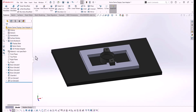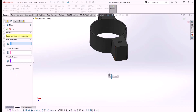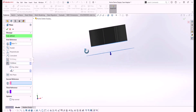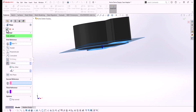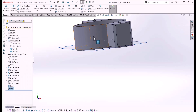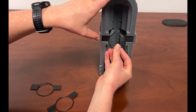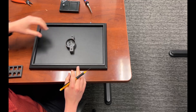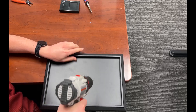As with the vacuum adapters, we set about orienting Notre Dame where we wanted it, reverse engineering and gathering our measurements, and then building out the representation in CAD. Once the CAD model is complete, it's always a good idea to validate your dimensions using unit tests. These are minimally printed objects that capture critical dimensions and features without burning up too much time and materials. Using planar cuts in CAD is a great way to control the size of these isolated features — I just wanted a section one millimeter tall. This takes only about 12 minutes to print, so I can quickly iterate until I get the dimensions just right.